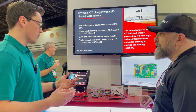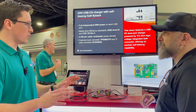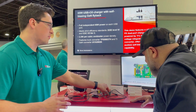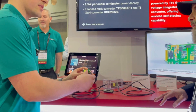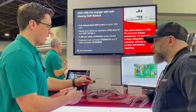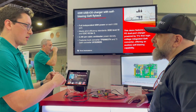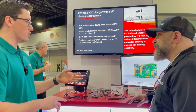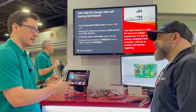Solution size is a huge factor with GaN, and one of the cool additional features is the self-biasing feature of the flyback controller. With self-biasing, you can get rid of the auxiliary windings within the transformer and reduce the additional biasing components needed to power the flyback controller. So not only are we reducing solution cost and component sizes, but we're also reducing the overall solution size — giving customers high efficiency, low cost, and a small solution size.